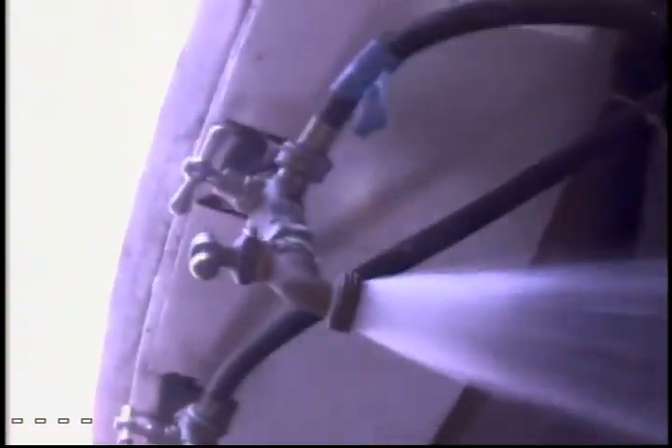This line is under the concrete slab running towards the house and kitchen, so it would be a dig-up repair if this line ever needs to be addressed. We've run water down the line on full blast — you can see nice good swirl action with all that water being sucked down the utility sink, so the drain is obviously functional and operational. We're just not able to get a camera down through that small opening on the cast iron part of the system. If this line is ever repaired, that would be the time to inspect it.